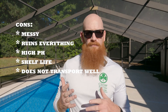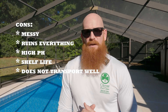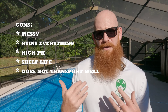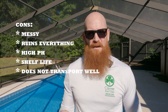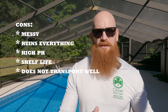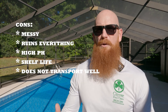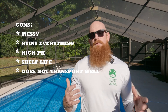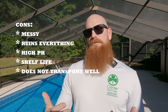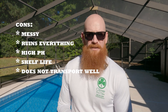Here are the cons. It requires very careful handling due to its concentrated form — it's very messy. You need to protect your vehicle and clothing; it'll ruin pretty much anything it touches. It can irritate your skin and eyes even more than granular chlorine. It also has a very high pH of 13, and it has significant decomposition during storage — if you have old jugs from last season, pour them into the pool because the chlorine is probably only a fraction of its original strength. Finally, the jugs are very bulky; as a pool service professional you'd literally fill the whole back of your truck just to get through one summer day.